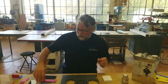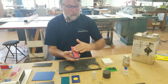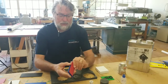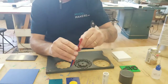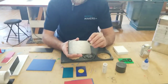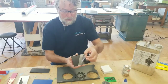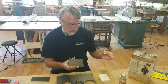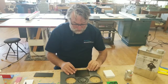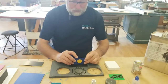With thinner pieces, you can glue them surface to surface — spread a little bit of the glue in between, smack them together, and give it a press. These were glued yesterday and you can see that's a really good bond right there. Some of the foam PVC — the Sintra and Celtec brands — come with a protective film. You certainly cannot glue to the side that has film on it, so remove the film before gluing. You can either glue surface to surface or edge to surface.